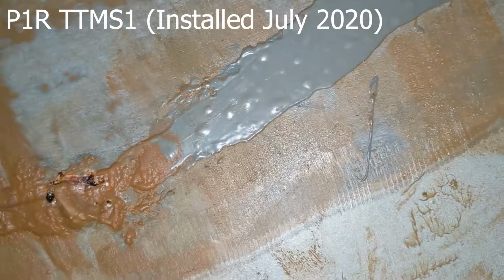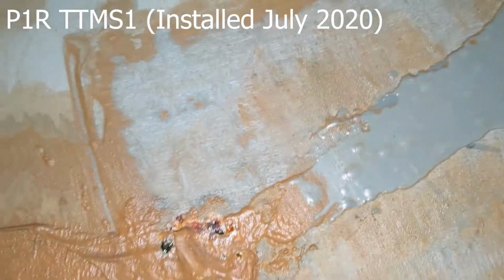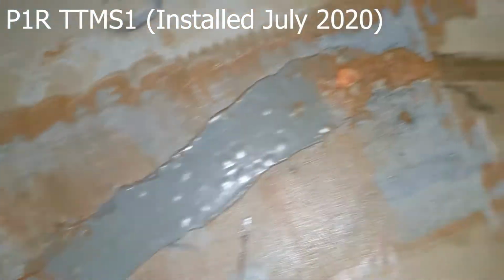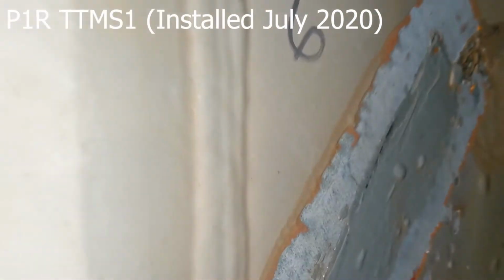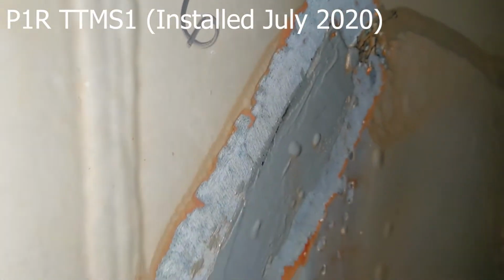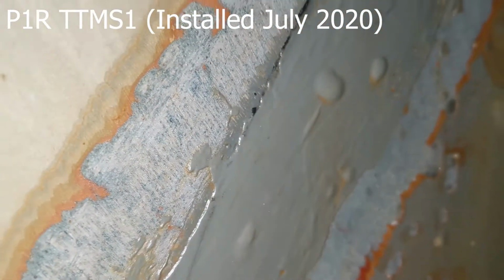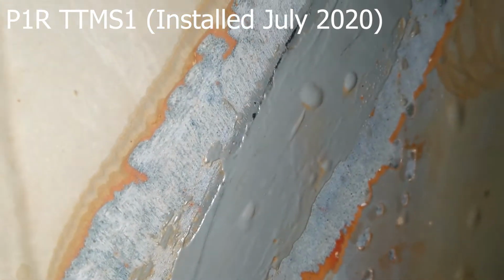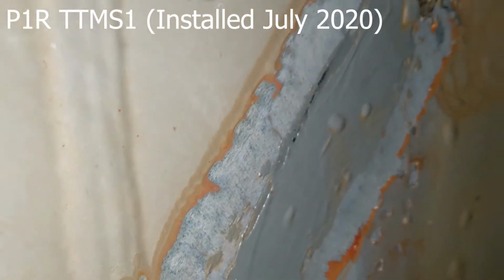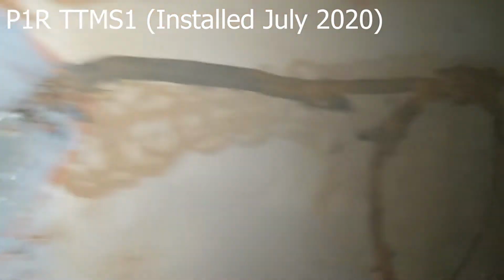Okay, you can definitely see them with the light. Now anytime a bubble would form underneath where the sensor location is, that's going to cause it to drift. Okay, I'm going to follow the loop around. This is sensor number 6, and this one in particular, you can see the fiber right there in a bubble that has formed right where the fiber is going. So if the sensor is right there, you definitely see that drift.